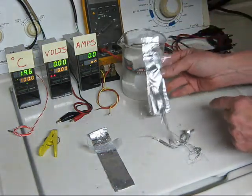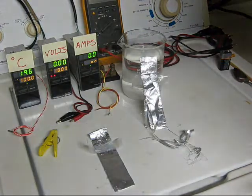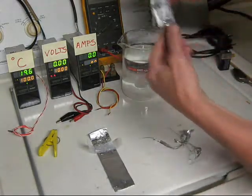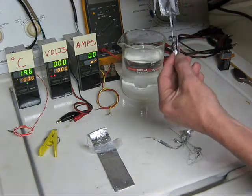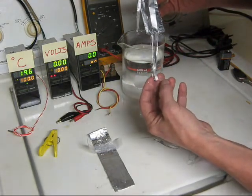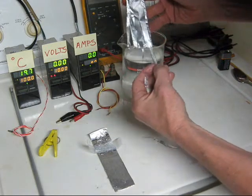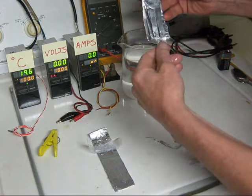I think that has to do with the way the aluminum foil was produced, how it was rolled out, how it was extruded. It may be worthwhile to take some of the foil I've been using and position it the other way while making these plates and see if it doesn't produce these sorts of things this way, which would actually be a bad thing, because it would mean with this, each of these strands is still a cathode, fairly well connected to the body up here. If these were this way, they'd fall apart. They would fall apart and disconnect, and the resistance would be higher. Electrical resistance would be higher. I'm just thinking out loud. Pardon me. So anyway,